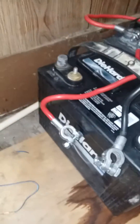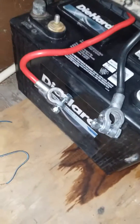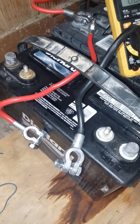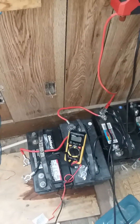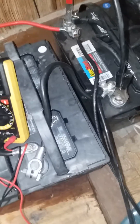So we effectively saved this battery as well. You can see it didn't fluctuate there, but this is a DieHard. I don't see a date sticker or anything stamped anywhere, but it was like a 2011 battery. It was a junkyard battery and it had very little to no charge in it — I think it had a 2.98 or something when I got it from the scrapyard. Either way, I changed it all out and as you can see in my other videos, you can save these. While some people may not recommend using these specific batteries for your solar battery bank, I'm telling you right now that they do work. You can use them as a get-by thing, and if you can get them for relatively cheap, they will work and you don't have anything to worry about.